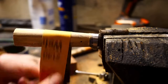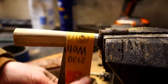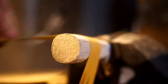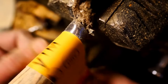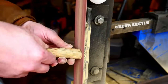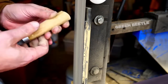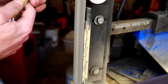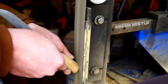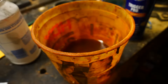As usual I'm going to start with about 220 grit on the wood, go to 400, 600, and 800. I usually stop about 800 — some wood does a little better with higher grit but in this case 800 is enough. And as for the oil, as usual, Danish oil. Danish oil has a couple of different oils within it so it's an amalgam, and I figure if you throw enough stuff against the wall something sticks — that's my super sophisticated approach to treating wood.